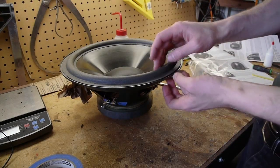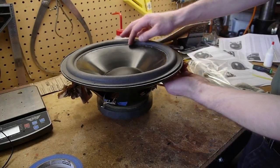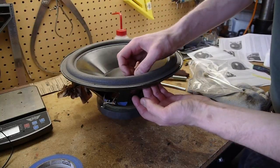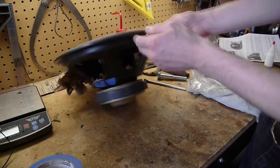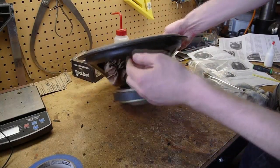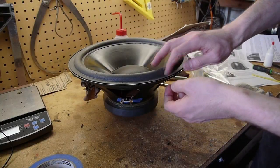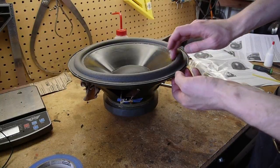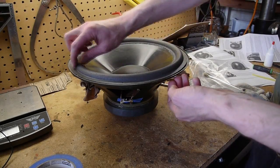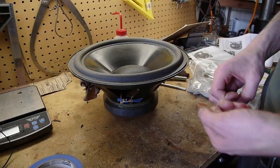After five or ten minutes, the glue becomes tacky enough where you can kind of pinch it down and it stays put. This will hold in place until it's fully dry in an hour or two. I've got the woofer cone packed up with paper to raise the whole thing up off the basket so that the surround is fully supported by the cone. This makes sure there are no gaps. It's actually pretty stable already, but I'll give it another half hour or hour to make sure it's fully cured, and then we'll glue the surround to the basket.